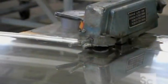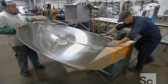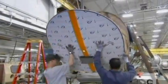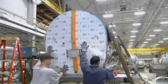Next, they prepare the outer wrapper heads using what's called a lock seam flanger. That makes a lip in the edge of the heads. They attach the front and rear heads to the outer wrapper by fitting the lip into the outer wrapper's grooved edge and crimping them together using a hammer.